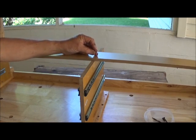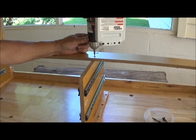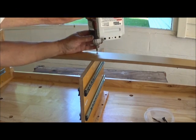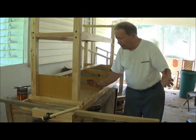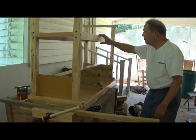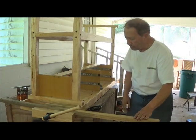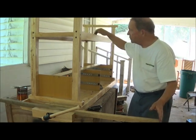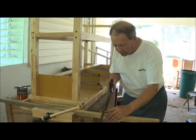Except for actually sliding in the drawers, these are the last two screws to be put in. The polyurethane is dry enough for me to handle it now. The only thing I don't like is in this tray right here — this member is long enough that it has some flex in the middle. So what I'm going to do is cut this piece of one-by and make a cross brace right here, put a couple of good wood screws in it, and that'll stabilize this completely. We're going to make our own little user modification.